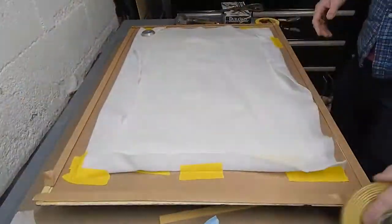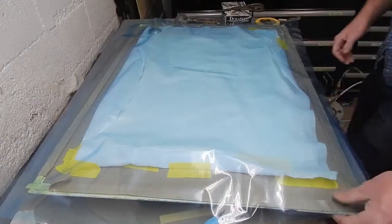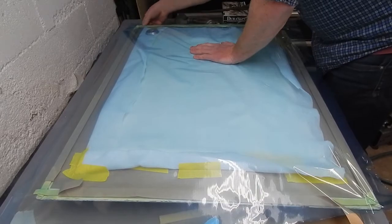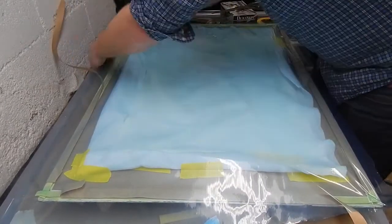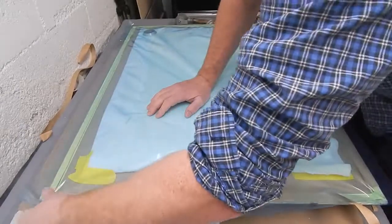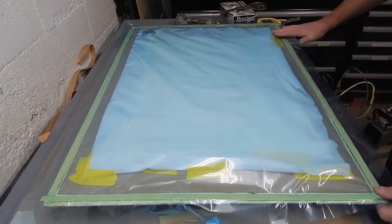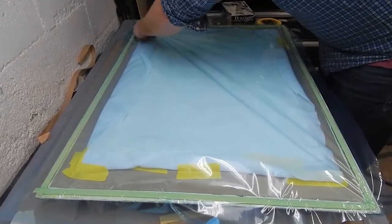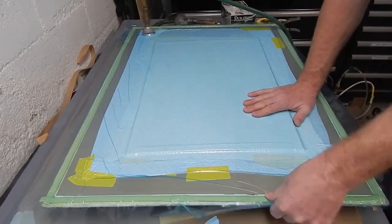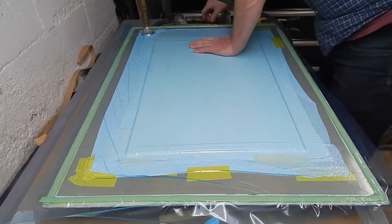Because there are no features to speak of on this bag, I'm just putting the bag right on the sealant tape. There may be one or two little tiny pleats but not much — I'll just let the bag stretch around. The whole thing is maybe a quarter inch high and the biggest feature is the vacuum plate. I'll make sure everything is stuck down nicely, check for leaks by listening and by looking at the way the bag is pushed in against the tacky tape, and cut off the flaps so they don't flop around in the oven.